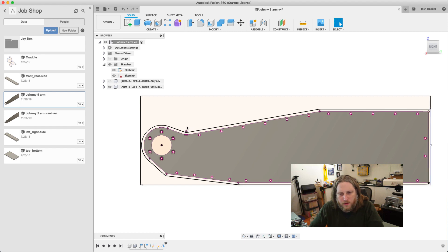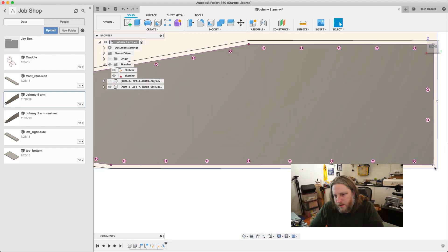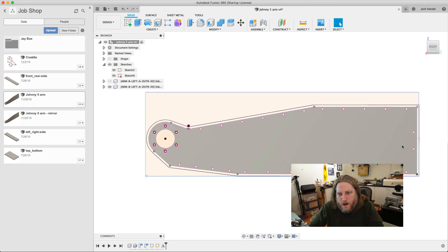This is 412 millimeters to this point. So very, very close — very right to my limits. Technically my machine is 420 millimeters of limit on the X. However, the block used for the inductive sensors to measure the stop actually limits that. So while technically maybe the frame handles 420, the block was really only giving me about 409 — and while 409 seems like a lot, it's actually not enough to make this part. So I actually had to grind it down until I could get to about 415 millimeters of distance off of that stop block that my inductive limit switches use. Once I was able to change it just a little bit, that was just enough room, and that gave me enough space to run this. Otherwise I'd have been much more creative.